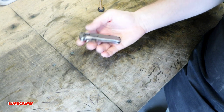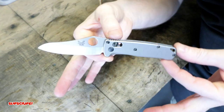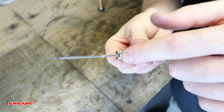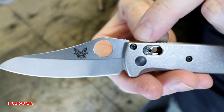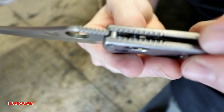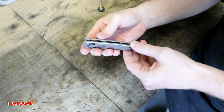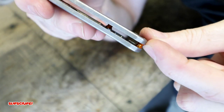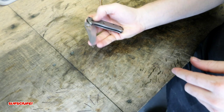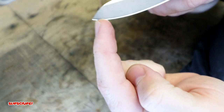Oh yeah, it actually functions — that is pretty cool! I think it looks pretty neat and different. I did round off that little bit up there so the blade sits a bit above the scales, but it doesn't bother me — I rounded it off so it looks good and I don't have to worry about stabbing my thumb. It's not a quick easy mod, but I keep hearing a noise — I'm hitting the standoff with the tip of the blade. So I'm going to have to remove just a little bit of the cutting edge tip so it doesn't hit that standoff.